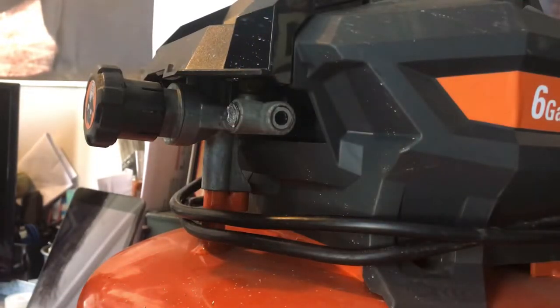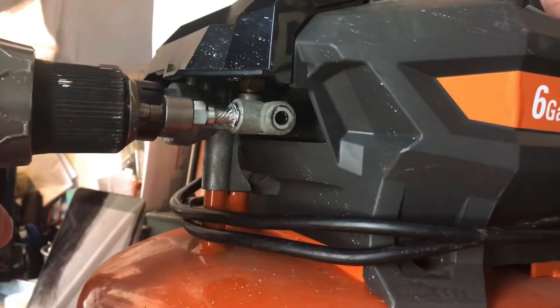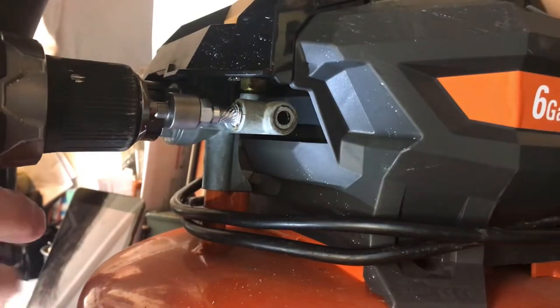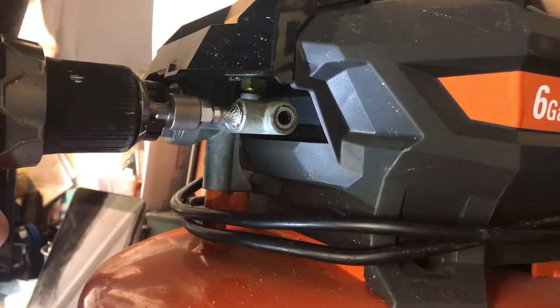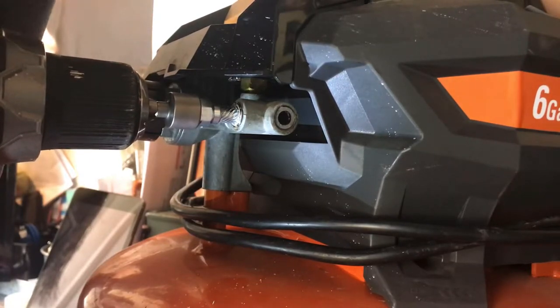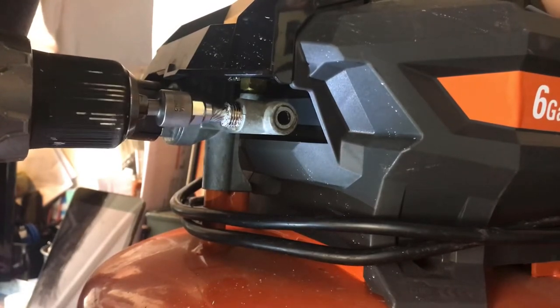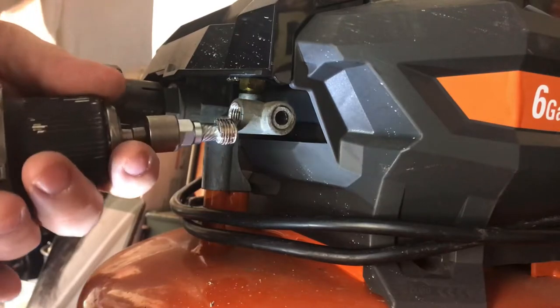All right, so you're going to grab your drill. You're going to put the bit inside here. You're going to hold it on one side, grip it, and push into it while you're reversing, and it'll grab eventually. It grinds a little bit, but it'll grab it and back it right out. And go easy. Okay, that's what you want to get out, this little piece here.